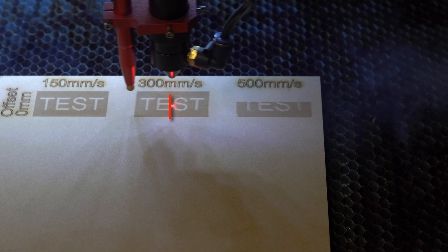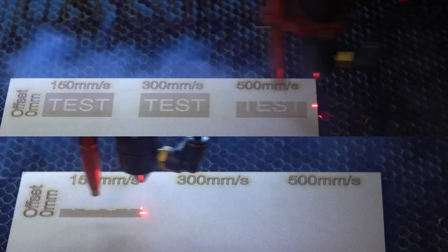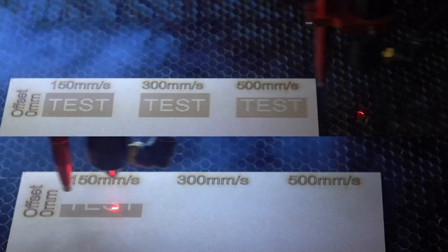If you have a three inch line to engrave, there will be some lead time before it starts engraving and some braking time after it finishes. If the laser speed is slow, the travel distance will be shorter than if the laser speed is faster. Now let's dive into how to adjust for each of these speeds to make sure that they all look the same no matter how fast you run it. To make this adjustment, you're going to go into device settings.